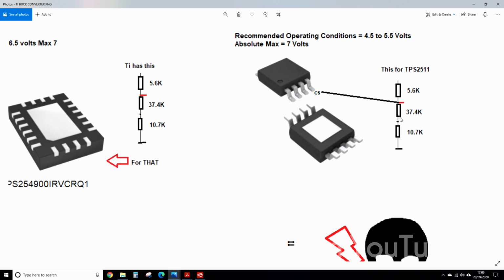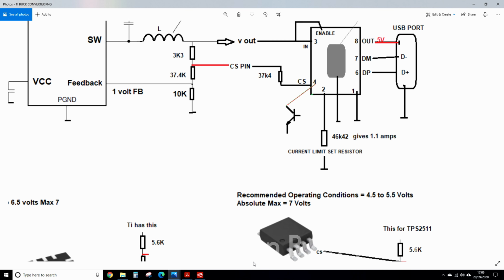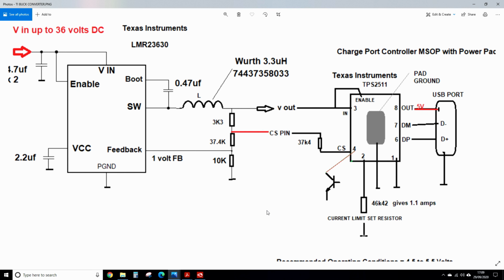So these resistors, if I go back up to the top now, I actually messed with them. When I put a 1K here, it would blow up. Put a 4K7, sometimes it would blow up, and I thought it was all heat and current. It wasn't. Started messing about with a potentiometer, put a 47K pot here, and it works exactly like it says.